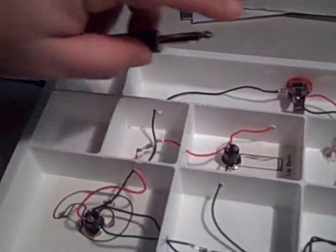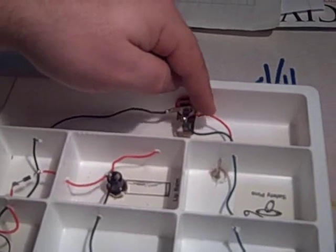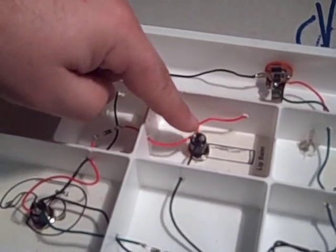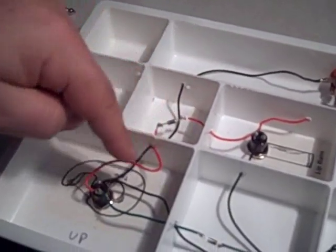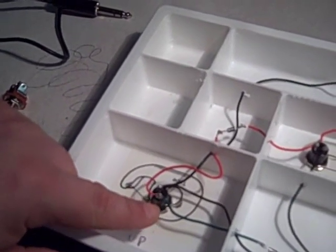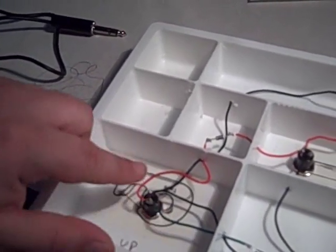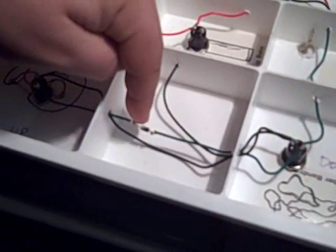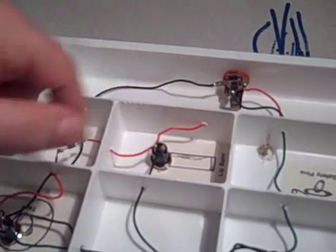Now let's look at the tip — I used red for this one. Red comes off the input jack and goes all the way first to the auto-record button, soldered onto the opposite post from the ground. Then it continues on — there's the second diode with the signal going that way — and the red goes to the up button, sharing the post with the green. So when you push the up button, you're really sending a signal out for both green and red. It's the up button that uses all of them together. The down button only sends green back, and the auto-record button only sends red back. That's how that works.